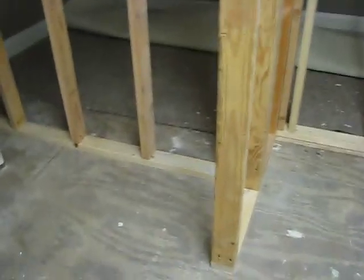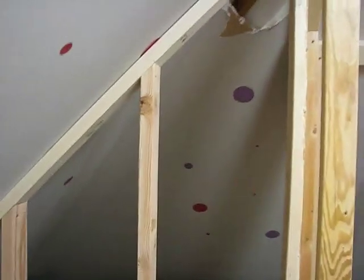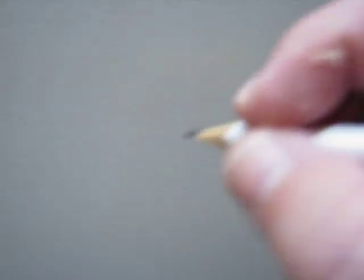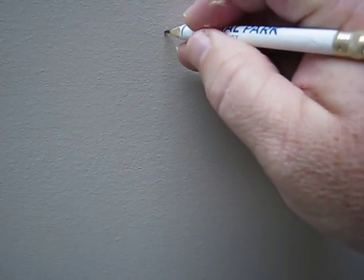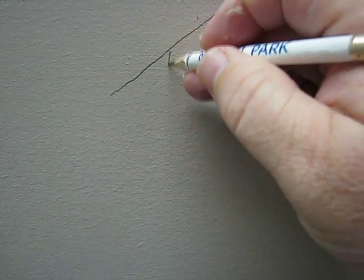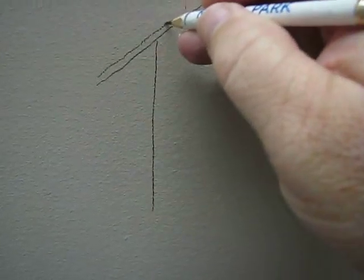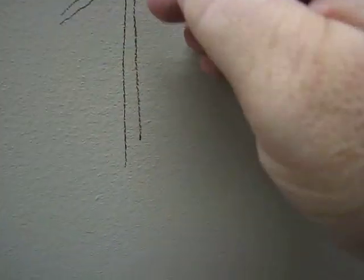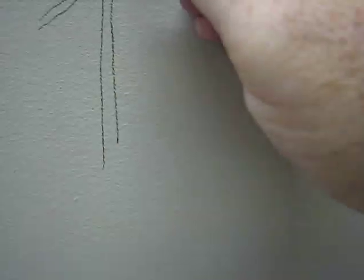What we did was we recessed it back into the attic, the new attic space. But Eric, let me show you what I was thinking about, this little door. We need to put a little door right here going into the attic, the new attic space we created. So what I want to do is, you got your wall come up like this. You'll have your stud, that's your plate, and your jack, and then your header. You just use 2x4 headers for this.